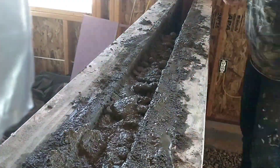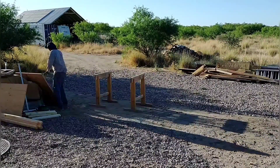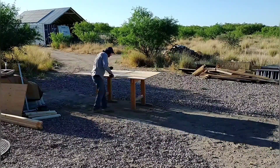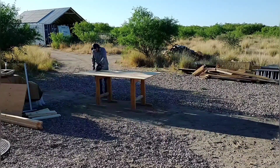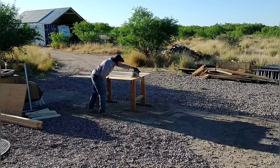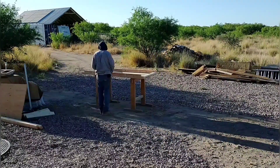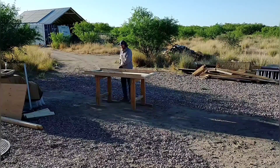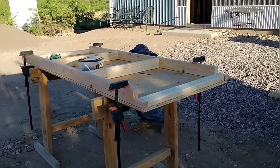In today's video we'll be working on our interior poured concrete walls. First up on the agenda was building the forms for the concrete pour. We bought some three-quarter inch structural grade plywood — still pretty expensive, about sixty dollars — cut it to size, and reinforced it with two by fours to make a strong structural frame, with two by fours on end going lengthwise and several going across.